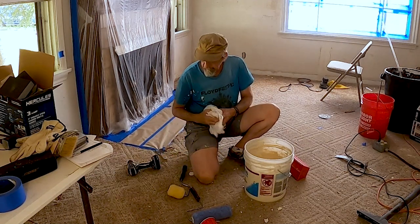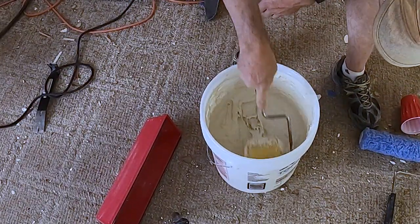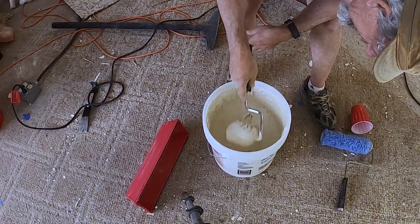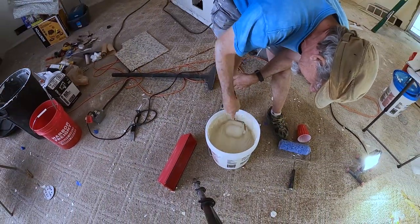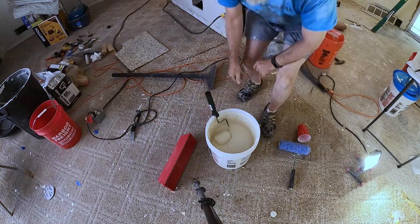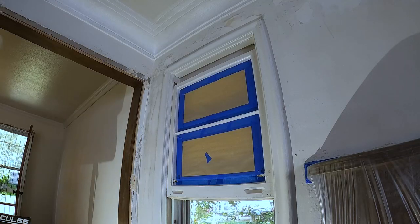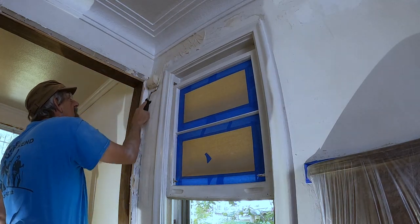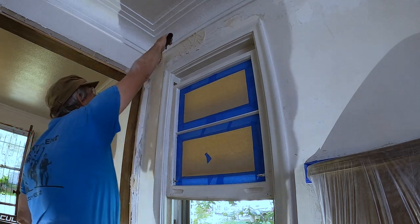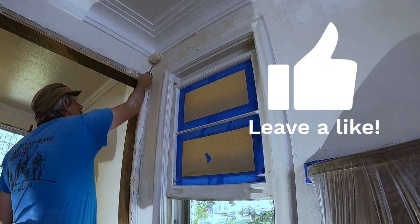Okay, we are ready. Let's get some light so you can see better. Now it's as simple as taking this roller — it takes a bit with a fresh one to get the mud to stick to it, but just get some mud on it. This is pretty creamy, it's about like pancake batter. I'm just going to position the camera over here. Then it's as simple as rolling it on the wall and getting it to where you don't have quite so much mud, because you're just leaving a light texture.